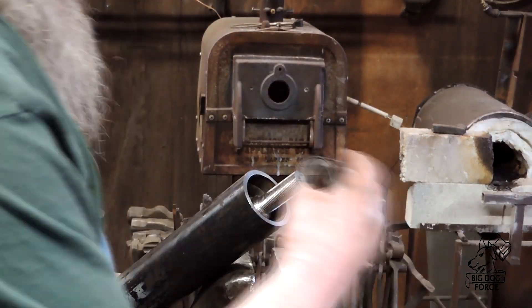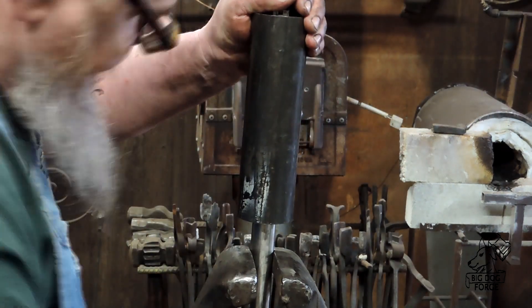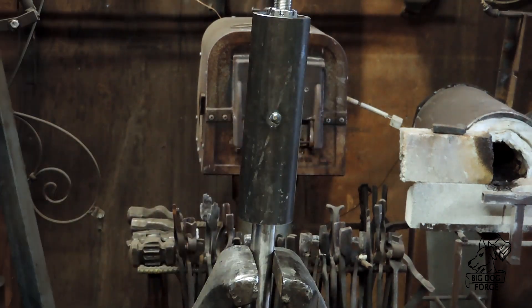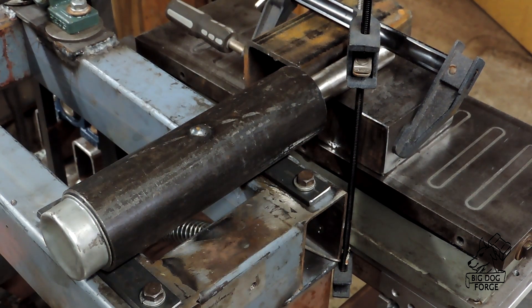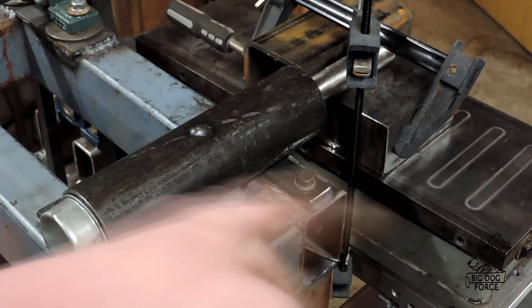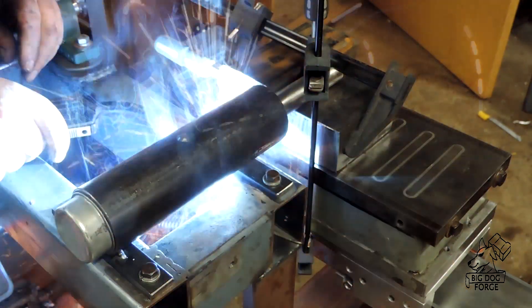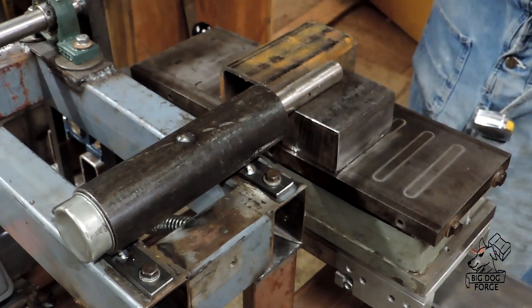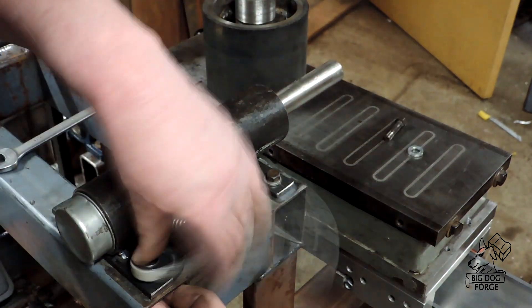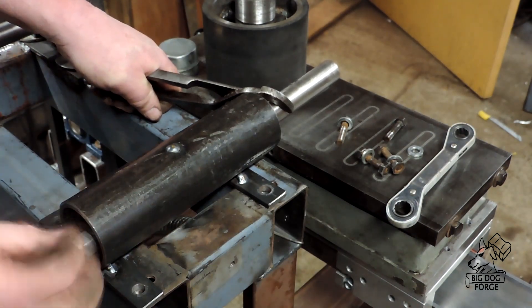We ordered brand new races and bearings from Amazon and they were here next day. This is our new axle — the axle is clamped down to two blocks with the magnet holding them at a 90 degree angle, so that shaft is going to be absolutely square with the magnet in all directions. We've got a couple of pieces of quarter inch by one that we mounted on the framework and we're just going to tack this in place. We'll pull it all off so we can do full welds on it and take the bearings out so they don't take any damage while doing those full welds.